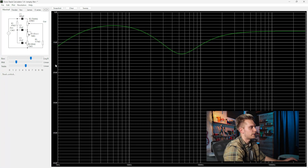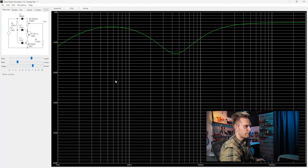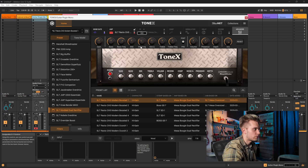With those component changes we get the rectifier EQ curve. What we want to do: increase the bass a little, kill some mids, and maybe increase the treble a little. Looking at the center frequencies, we're talking about 450 Hz for the mids. The bass is moving lower than 100 Hz. I won't get over-complicated with treble frequencies — that might be a topic for a separate video. So we're going for a 450 Hz mid scoop and a bass increase around 90 to 100 Hz.